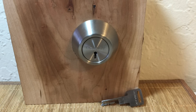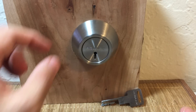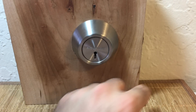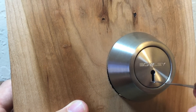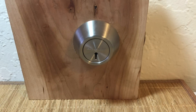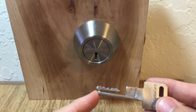Some quick details before we get into the diagrams — the first thing you should know is that this is a hidden keyway lock. This chamber here is not the keyway; the real keyway is actually hidden at the top behind the faceplate. This chamber has no pins in it, nothing you can manipulate — it's just an empty chamber. Similar to the forever lock, there's a key chamber you load up and then you have to move to the proper position to get to the real keyway.